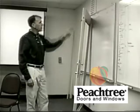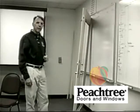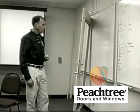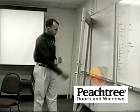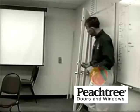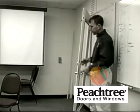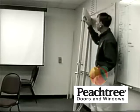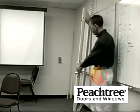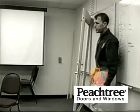If for some reason the bolts are still not engaging or coming out into the deadbolted position, there are a few things you can check. One would be, in the unlocked position, to grab one of the bolts and, as you gradually turn the thumb turn on the inside, pull in the bolt. This might help the bolts come out, clear some debris inside the panel, and free up the lock, and after that it might work just fine. So gradually pulling on the bolts while turning the thumb turn might free up the operation of the lock.